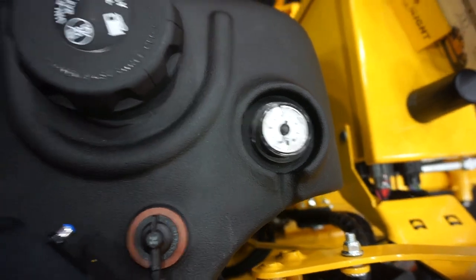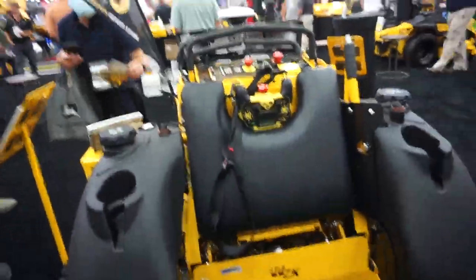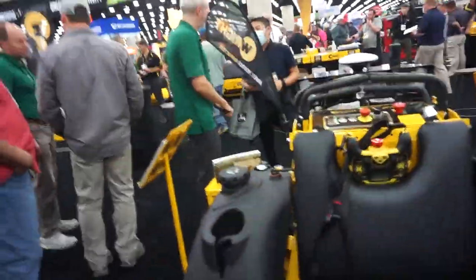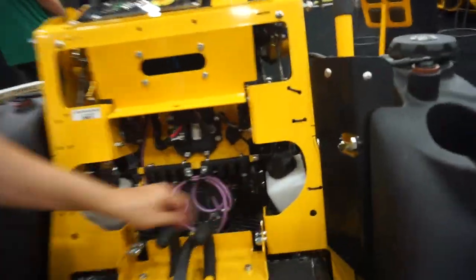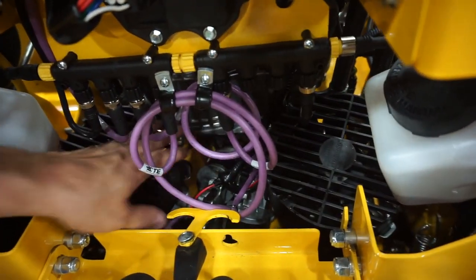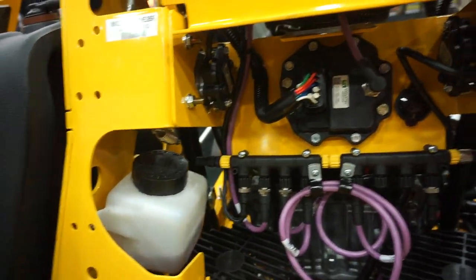Ed's going back to the future with what we're calling the analog fuel gauge — great combination of computerization and realization. The wheel motors are standard H-series 15 cubic inch wheel motors. The pumps are normal pumps but with an actuator — kind of like a windshield wiper motor — controlling the pump displacement. The actual hydraulics are normal parts. It's IP69 rated, all sealed, so it'll operate in the rain. Electronics and mechanical adjustments are really easy to access.